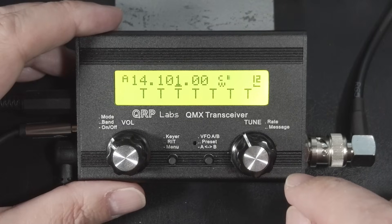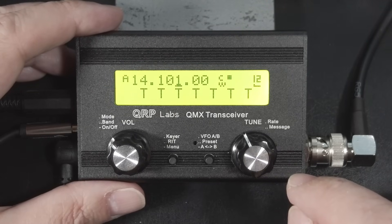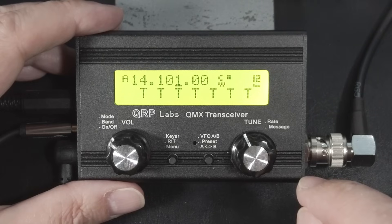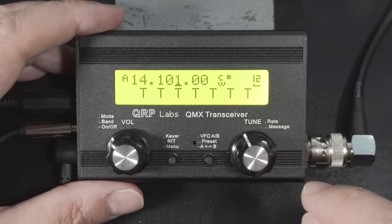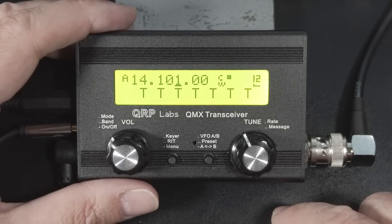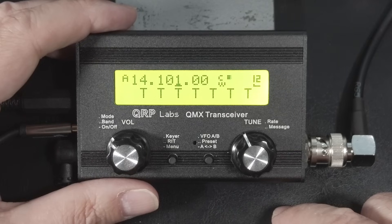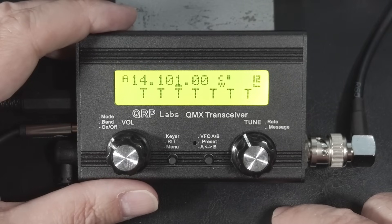The menu has quite a few settings. For CW, you can operate in full or semi-break-in mode. The CW pitch is configurable along with the filter bandwidth, which can be set from 950 Hz wide all the way down to 50 Hz — that's kind of uncommon for rigs like this. It also has automatic gain control configurable in the menu, high SWR protection, and high voltage protection. Some other cool features: it can beacon, and you can use it for digital modes like FT8. There's also an interesting mode that outputs a continuous tone at a certain percentage of your maximum power, like 50%, so you can use it with a manual or automatic antenna tuner while it displays your SWR.